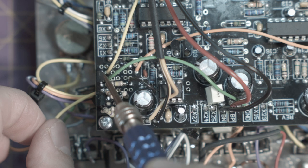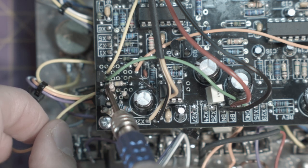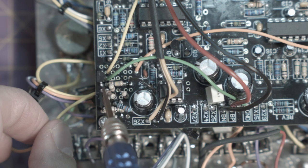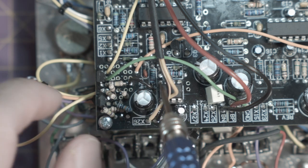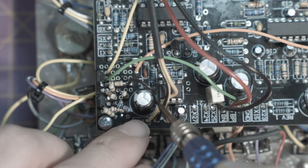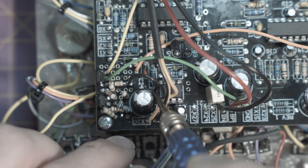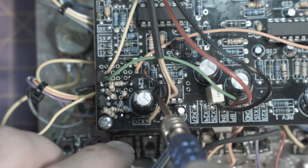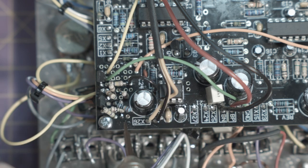This is the VCA over here, and this is the VCF. This transistor gate also has a 100K that is connected to these two pins here. And then this wire, it's difficult to see. I desoldered this leg of the resistor and stuck both the leg of the resistor and this wire through because this point is battery negative. This point up here is also battery negative, but I already had two resistors soldered in there for the VCA, so it's just difficult for me to get to.